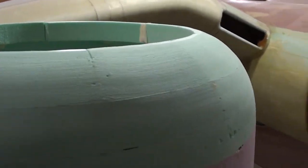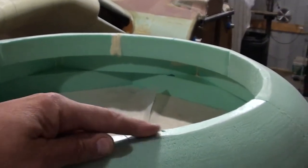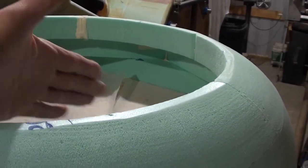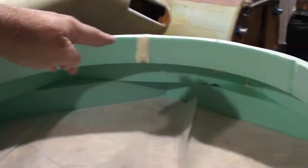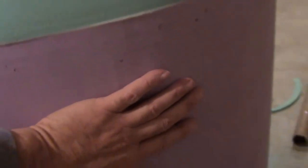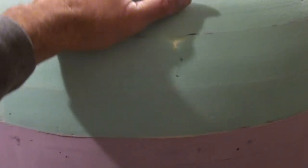There's a real light spot there, but it looks pretty good. This inside is actually oversized. When I get it in the jig, I'll probably work on cleaning up this opening. Because when this thing is fiberglass after it's all said and done, all this foam here is literally removed from the cowling. This front cowling gets two layers of glass on the outside of the whole thing, two layers on the inside. But on this nose cone, it takes a total of four layers of cloth on the inside instead of two.